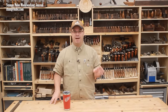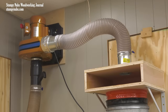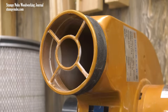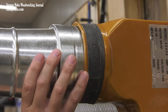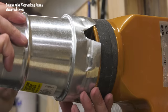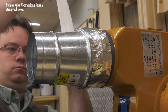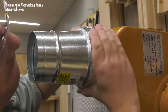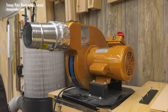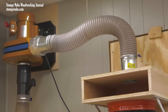So how do you attach your blower to the box? That depends on the blower itself. If it has a 4-inch outlet, you merely run a hose from the blower to the collar on top of your box. My blower presented a bit of a challenge because my outlet was slightly larger than 5 inches. I purchased a 5-inch to 4-inch adapter at a home center, but it wouldn't fit over my blower's outlet because the end was flared. My solution was to notch the adapter and stretch it over the outlet. I used a mallet to form the steel over the lip on the flared end, then wrapped it in four layers of good foil tape. Foil tape lasts longer in dusty environments than regular duct tape, and the result was plenty rigid for my uses. Remember, this is the blower outlet, not the inlet where the suction hose attaches — this connection is not going to be stressed after it's mounted on the wall.